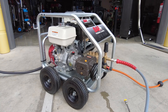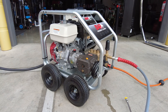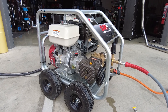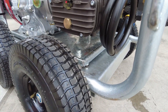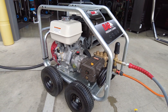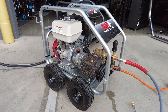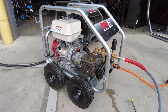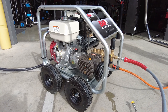The first machine we're going to discuss is 3500 PSI at 15 litres per minute. This is an industrial version in a roll frame. It features a reduction gearbox, low speed pump at 1450 RPM, pneumatic tires, and a vibration isolating plate — so when this machine is running it sits still. We can put a 30 or 60 metre hose reel on top and this will run all day every day. It has an external unloader valve and I'll drop links below where we can bypass that and run it back to the tank to save overheating the pump.